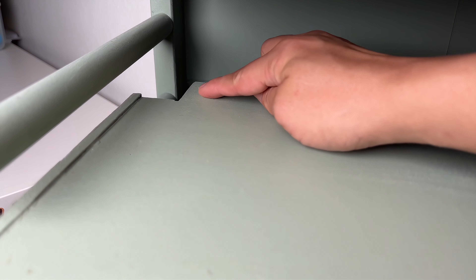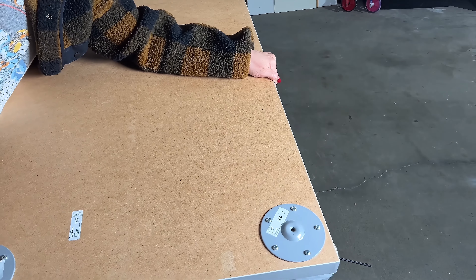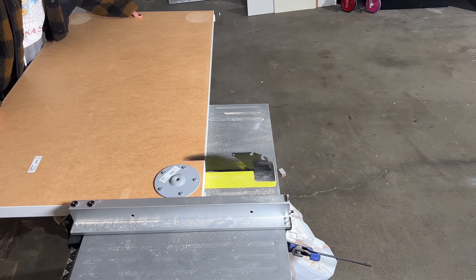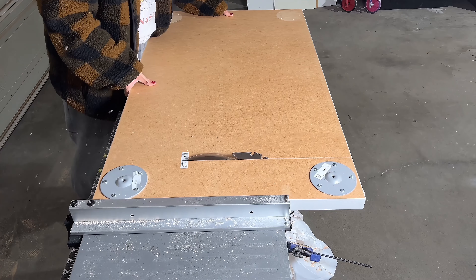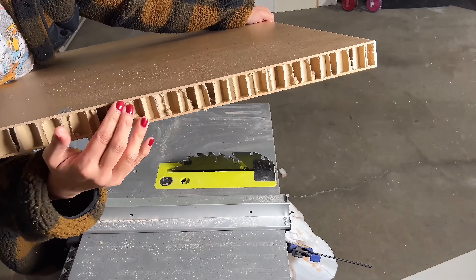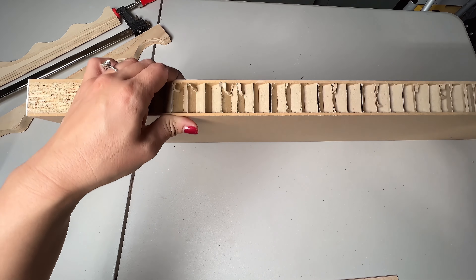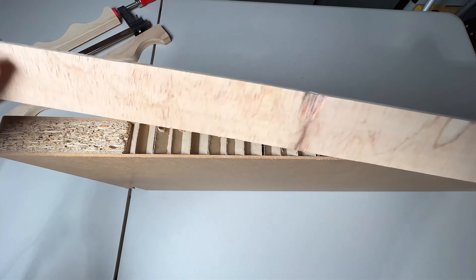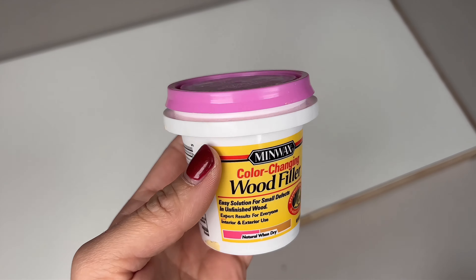With the crib there is a little divot, so I have to cut a little bit on the ends of each shelf so it can slide in perfectly. I am also cutting an old IKEA table, removing the side where there is a circular spot for the table legs. The table is pretty lightweight — it turns out it's hollow inside. To cover it up, I used a thin piece of wood glued on with wood glue, and once it dried I filled any spaces or creases with wood filler.